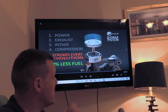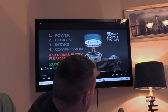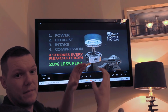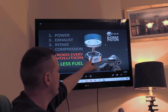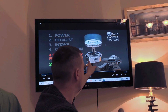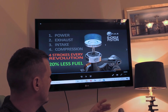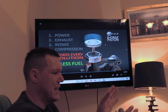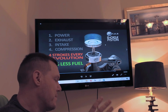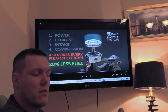So the other thing is the rocking moment. What's going to happen is that as this piston, the crown in a sense, goes up, it is on a pivot, right? And there are no skirts to this. Now you could put skirts on the side of it, so that it could slide in between there. You could cut a centre section out. You could do that, right? Just because you see a problem doesn't mean that problem can't be solved.